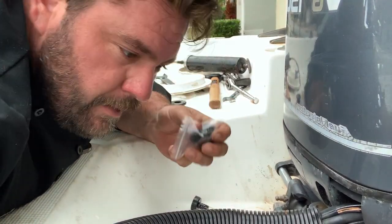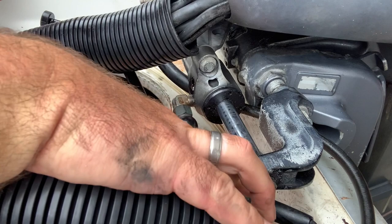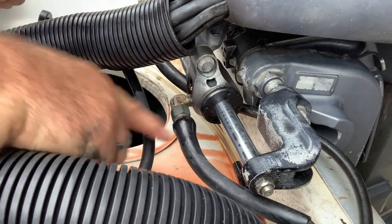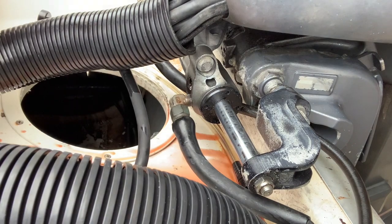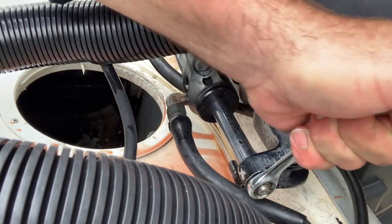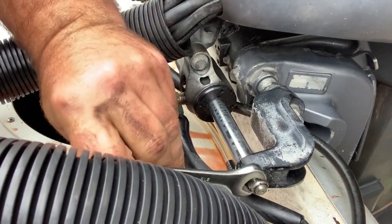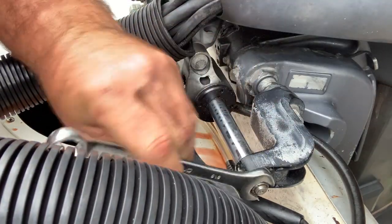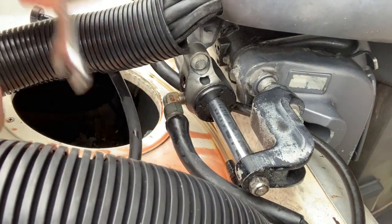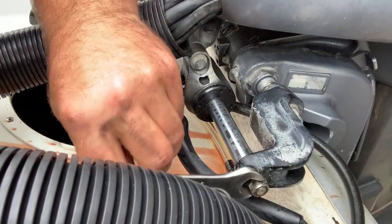Here's the new cap. We're going to go down there, remove the old one. We gotta remove the 5/8" bolt, the 3/4" back here, then use the specialty tool to remove the end cap, and then put the new end cap on. Here's our 5/8" — if you notice I made a mess. I got a rag below it to catch any of the hydraulic fluid — it's going through my little scupper holes back here. Make sure you don't pollute the environment.